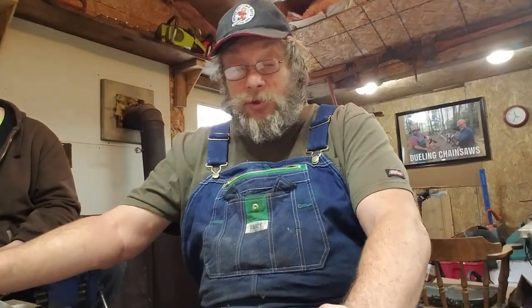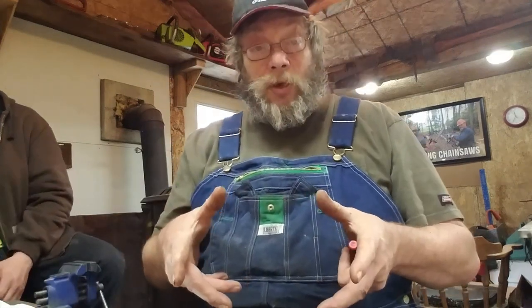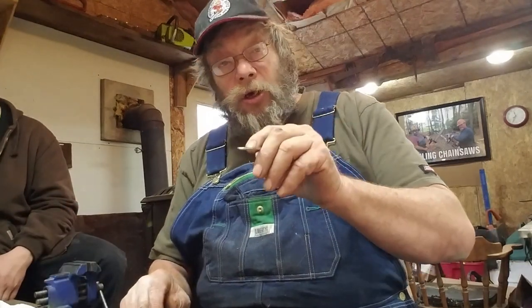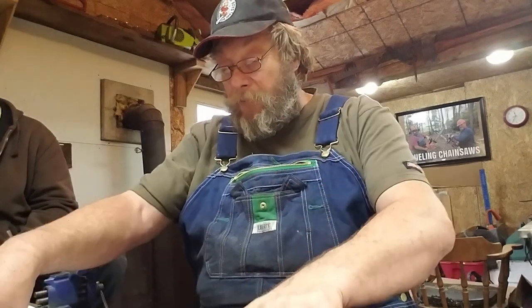Okay, so fine. Why are you telling me this? How's that affect the chainsaw? Yeah, it does. When you have a round log and your chain and your rakers are optimum, but it's a monster, and you start cutting in, you reach a point where it'll get grabby because it's cutting in the circle part of the grain, okay?